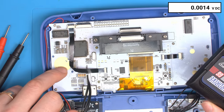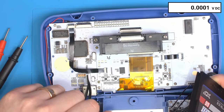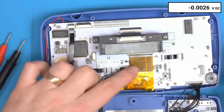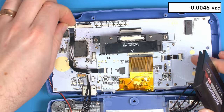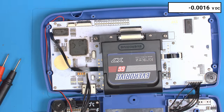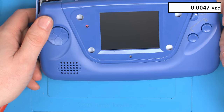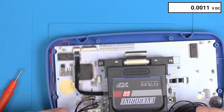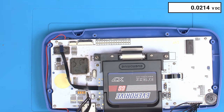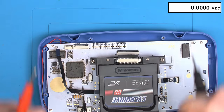To confirm I'm not just making a presumption, I tested this against an original board and it does exactly the same — so it's not this board. We also have a brand new clean screen 2 with new buttons, new FPGA, new code, so we're not sure yet if this is interfering. To prove that, let's disconnect the clean screen altogether and get into a Master System game. While it's running, disconnect the clean screen so it can't interfere with the SMS pin at all.